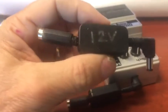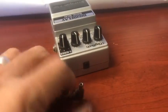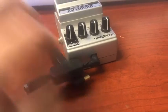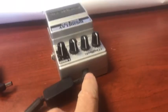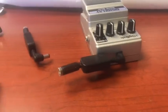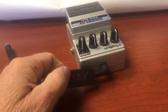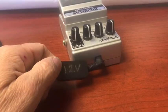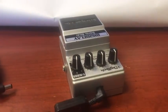Also, these ISO plugs can be done in 12, 18, or 24 volts. What's cool about that is it takes the standard 9-volt guitar input, isolates it, and bumps it up to 12, 18, or 24 volts. So now you can run one 9-volt daisy chain to all your pedals by simply putting the correct ISO plug on. The whole system platform is 9 volts, and the voltage is bumped up and isolated before it hits the guitar pedal.